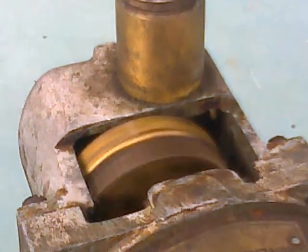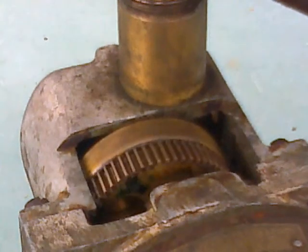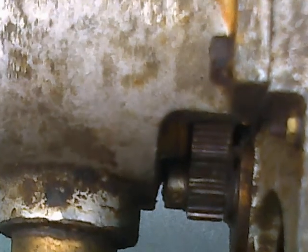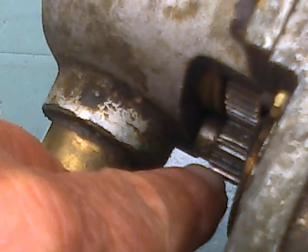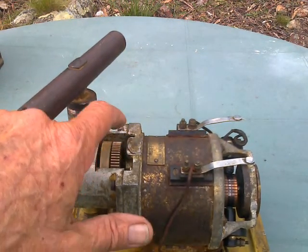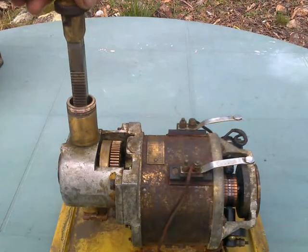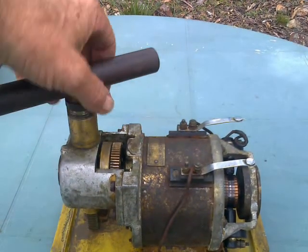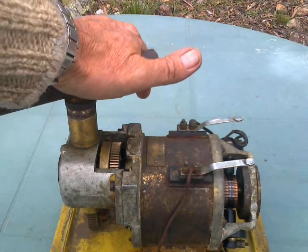The ratchet is in the plunger. The ratchet drives the geared wheel. I did have those gears right in there in the center — I think it's a three-and-a-half to one step-up ratio between this and this. One plunge gives two turns... one turn... three-and-a-half turns. What that gives you is seven and a half turns of the armature for one plunge. I know this because last night we actually marked the teeth and counted them.